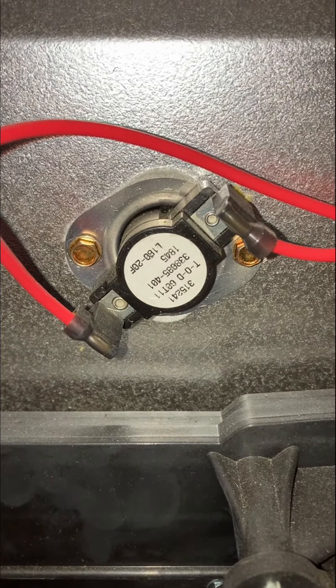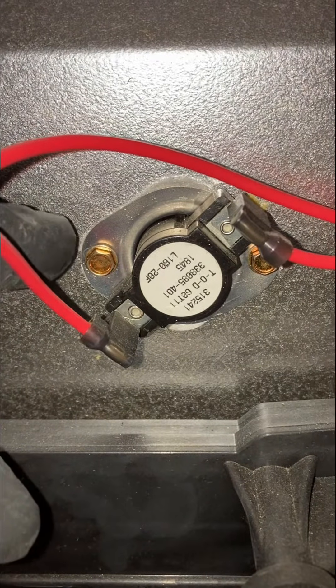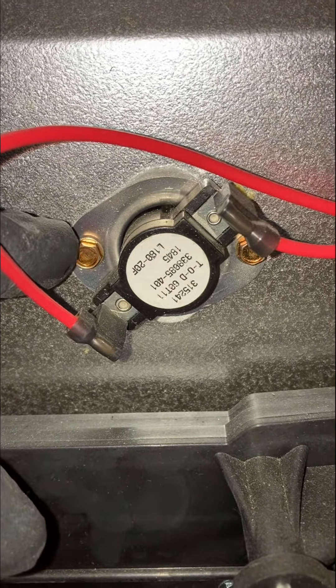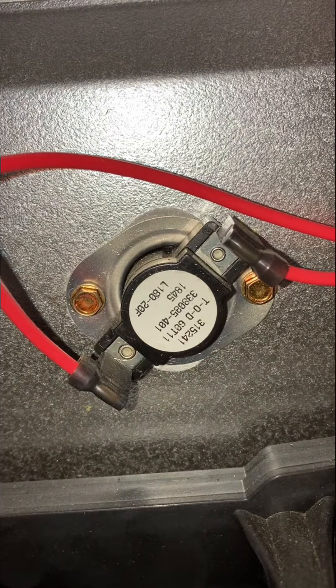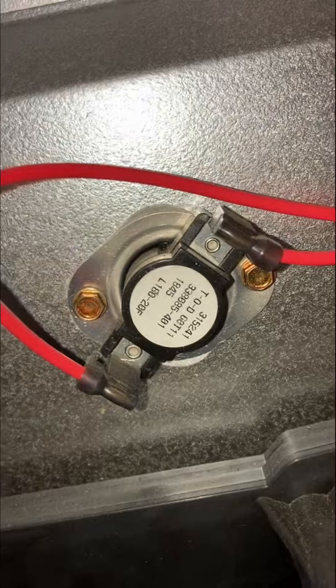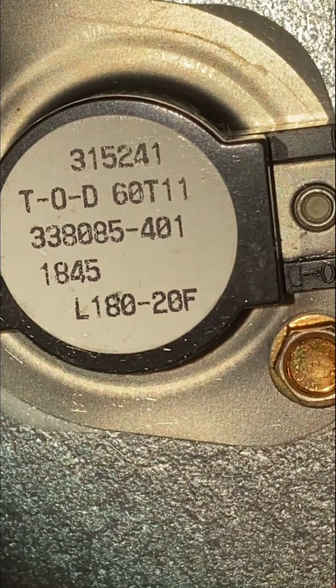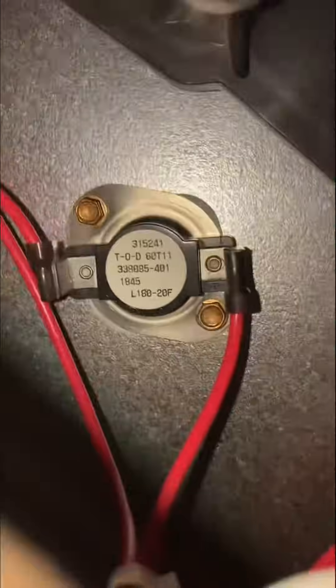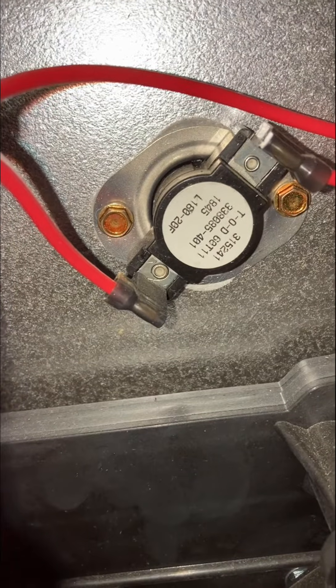Some people would just swap it out and say it's a bad high limit. They take out this screw, put a thermocouple in here, and say their thermocouple is showing, let's say, 150 degrees. And this switch is rated at 180 degrees to trip and 160 degrees to reset — that's the minus 20 there. So that's not going to fix anything by replacing it, even if your thermocouple is showing a lower temperature reading.